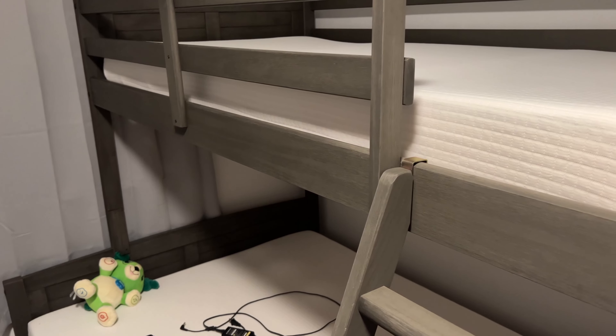I tried not installing the slats on the bottom bunk first, and when I was trying to put the two top rails in place, the top side rail on the back came out — it uses dowel rods and screws — and it came crashing down just enough to break the dowel inside both the side rail and the headboard. I had to run to the hardware store to get extra dowel rods, which of course were not the exact size, so I had to use some glue as well. They did not give many spare parts.